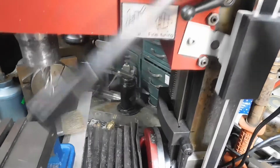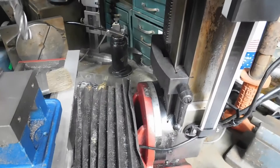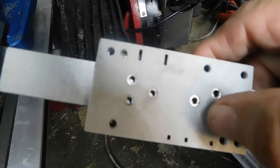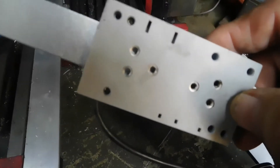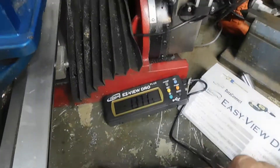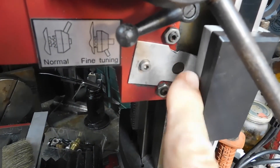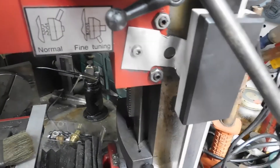The next thing you have to do is make a bracket. Because on the back of the sliding piece there's a whole series of holes. They give you screws and they give you some brackets — the end brackets I've used, but the internal brackets I have not been able to use. So you have to make a bracket that mounts to the back here, the sliding device, and it will mount to the mill.